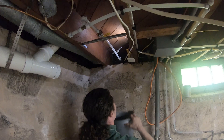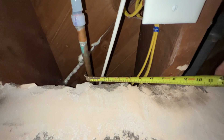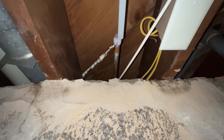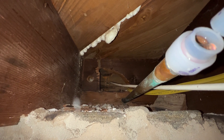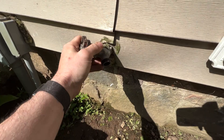Let's go pull that old one out. While we're down here, let's take a quick measurement. We are seven inches over to this joist and seven and a half inches over to the other joist, so we've got about a 14-inch span — we're pretty much centered on it. We may have to drill here and here and then fill that hole in. As long as we stay on the same plane, we should miss all the wires.